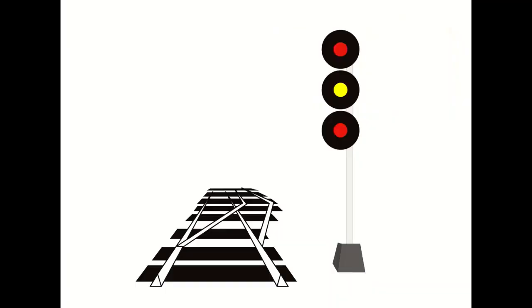We were just given 2 miles warning of what the next signal is displaying, and simultaneously told what to do at this signal. Now, knowing what you know now, you might just be able to figure out this signal. You guessed it, medium to stop. So if you're driving the train, you must pass this signal going no faster than medium speed, or 30 miles per hour, and expecting the next signal to be a stop signal. So you'll be preparing to stop.